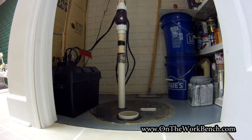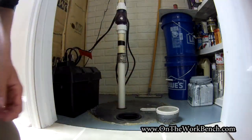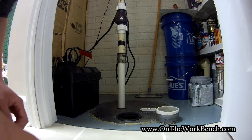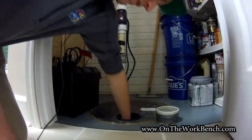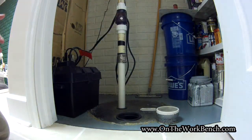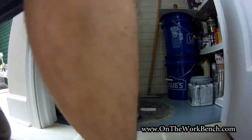I had to get out the gasoline generator and connect in the AC pump and pump switch to get it to work. Today it's time to diagnose what happened. The first thing I'm going to do is get access to my switch here and try to manually activate the pump and we're going to see what happens and what sounds we hear when I try to raise the trigger for the DC pump. If you heard that sound, that was a sound of the pump trying to start but not starting. So we've got a problem.